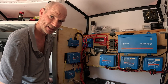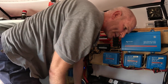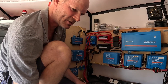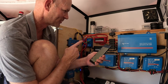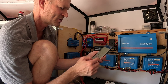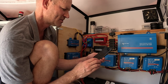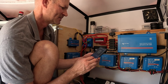Let's go and see if this goes pop. I'll go downstairs and turn on the supplies. Power is on - no smell of magic smoke. Now I need to open up the Victron Connect app. I've opened the app for programming the devices and I can see there's a new battery protect showing in the other devices - it's not assigned to my system yet. I can select it and set the PIN code for the Bluetooth, which defaults to six zeros.